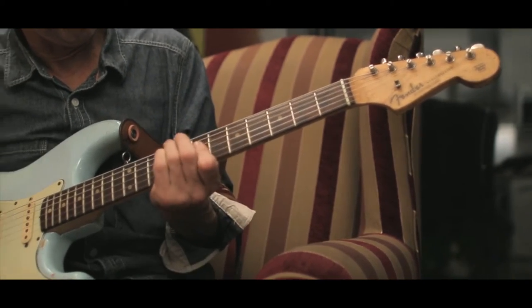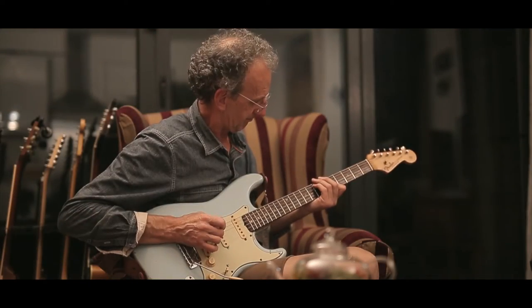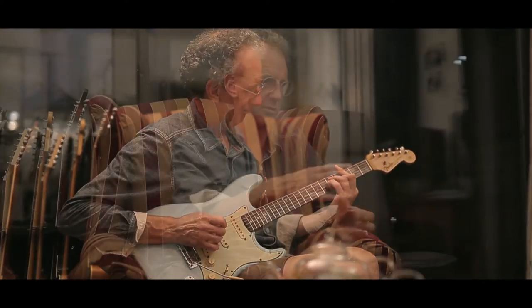Subsequently, as I've owned it over the years, another one has gone open circuit. It's very common, sadly, with those older Fender single coils, that the wire that makes the coil, the thin wire, will kind of oxidize and break, and the pickup still works but it sounds all thin and horrible. And so, yeah, they need basically rewinding. And so now two pickups have been rewound.